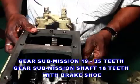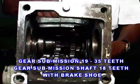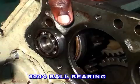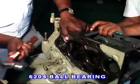Insert the shaft, 18 teeth, with brake shoe from the right side of the gearbox. Then fit gear transmission, 19 and 35 teeth, to it with brake shoe. Then put a spacer and fit a bearing on the left side.